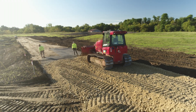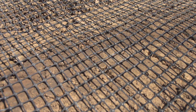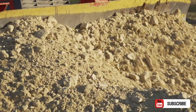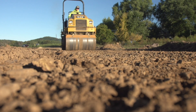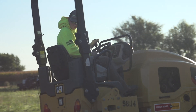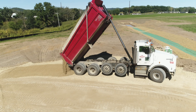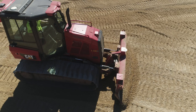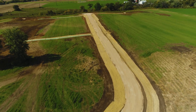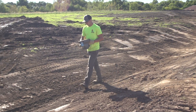After the ponds we went to the ditches and built our road. We had a couple of areas on the road that were kind of unsuitable soil that we dug out — that's where we put the geo grid down and added some more breaker on those areas. We just started rocking everything, getting our grades all the way up to our final grade with rock. In total we had roughly a little bit over 5,000 tons of rock between three-inch minus breaker and three-quarter inch gravel base rock.